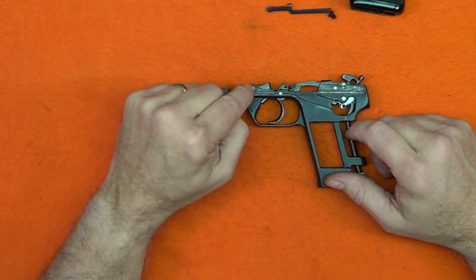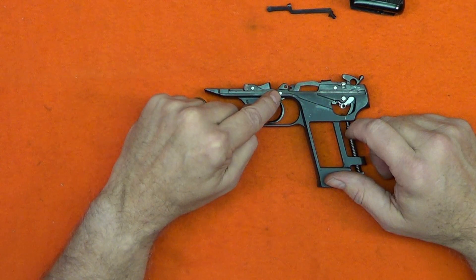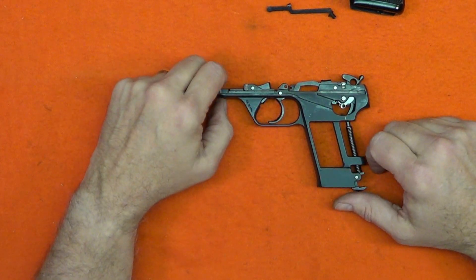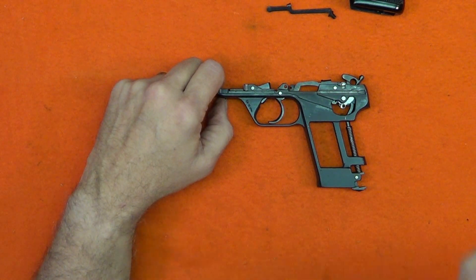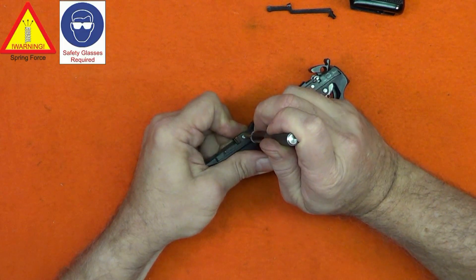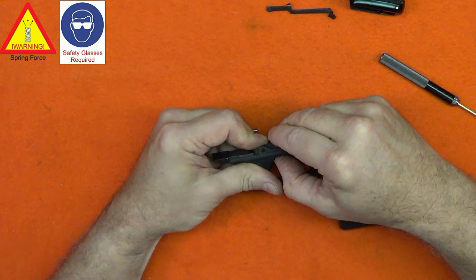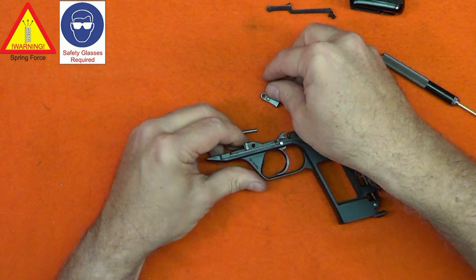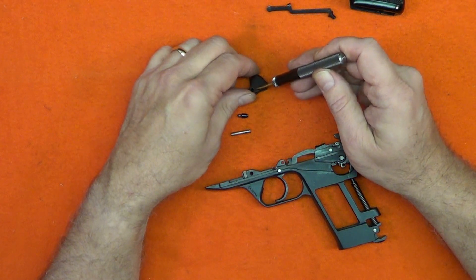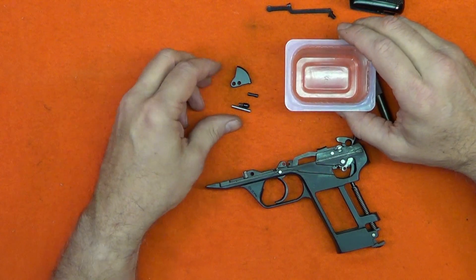The frame components are retained by five pins — one each for the barrel clamp, the trigger, the ejector, the hammer, and the magazine catch. They are all under spring pressure, but can be easily removed with a brass punch. To remove the barrel clamp pin, apply some down pressure to the barrel clamp and press out the pin. Slowly release the pressure on the barrel clamp, as it retains a spring-loaded plunger. Remove the clamp, plunger, and spring. Be careful to note there is a black pin on the barrel clamp — it is very difficult to see and can easily be lost. This is the stop pin. Keep all parts grouped, separated, and contained.